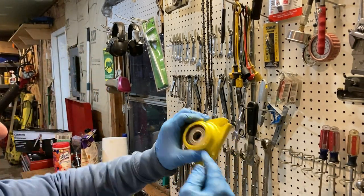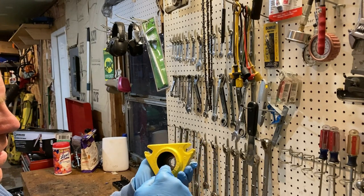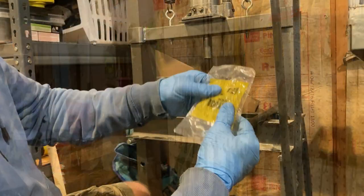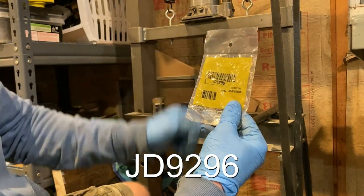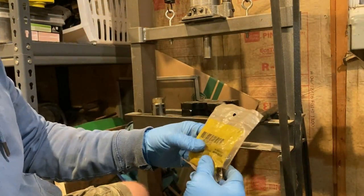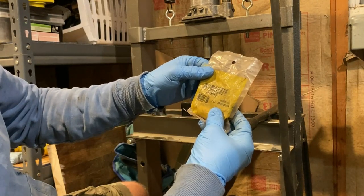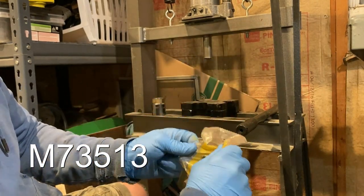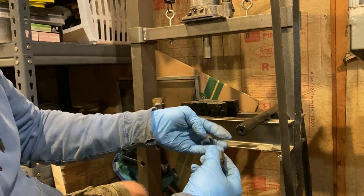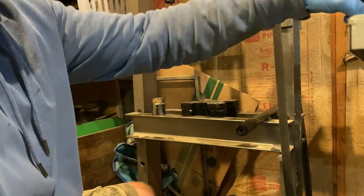So that thing's secure now. There's a little spacer that goes in here, as you probably saw when we took them out, but this is a lot cleaner. Then there's a bearing that goes here and we'll put the shaft through. The bearings are JD 9296s. I figured I would use them - I've had these for a while and just haven't used them. This is the deck I'm going to do a complete rebuild on - this is M73513. These are the spacers. I had some issues with spacers on some of the decks, with some of these things too far separated.